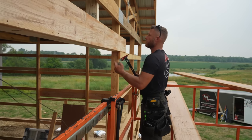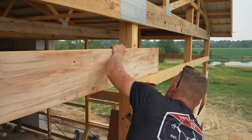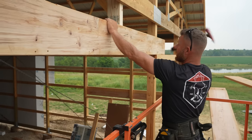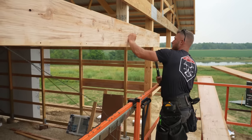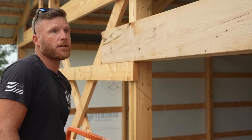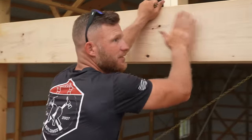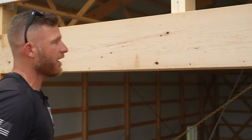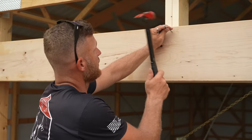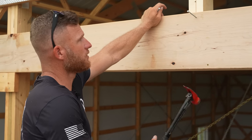There's a lot more nailing I'll probably do — I'm just trying to get everything connected before this storm comes. Now you can kind of see the header that is starting to develop. It's not structural from a load-bearing standpoint — we just need it to be nice and strong so when the door pushes and pulls on it it's not going to go anywhere. We still have a lot more framing to do, but I don't know how much I'm going to get done today with the weather.